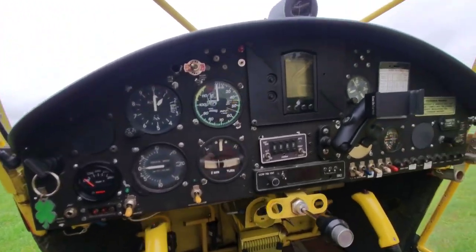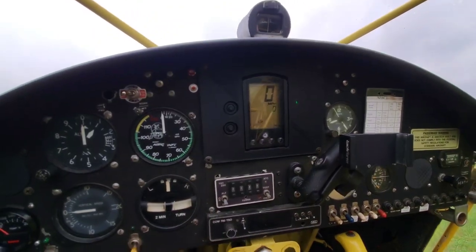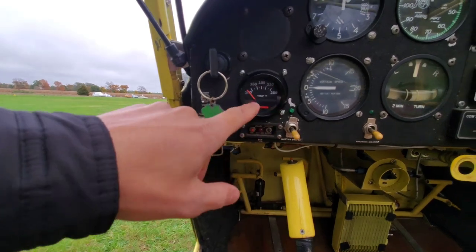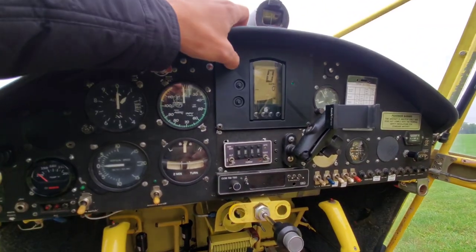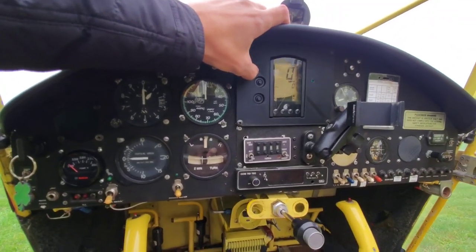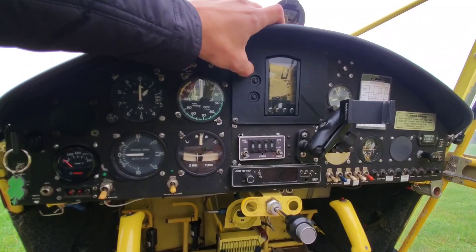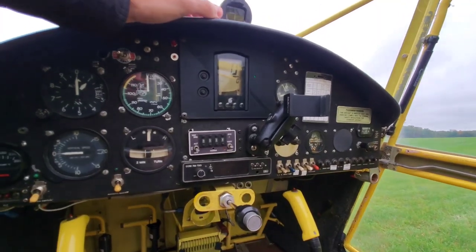I changed the panel — the display is from the snowmobile, and that's what we're using for main engine monitoring. The airspeed shows up on the snowmobile speedo, which is pretty cool. I have an oil temp gauge, and beyond that I'm using all the dummy lights on the stock cluster. The stock cluster gives you more information than people think — you just have to go into sub-menus to view it, which isn't practical in flight, but fine for testing. The dummy lights do their job and let you know if there's a problem.